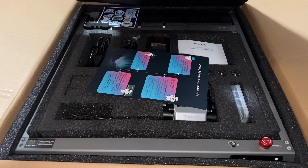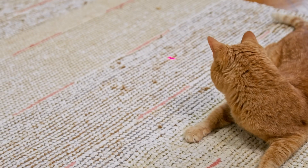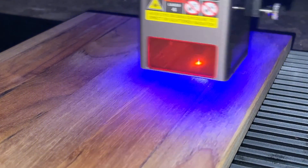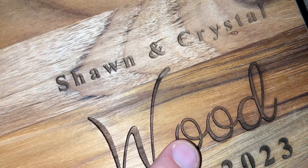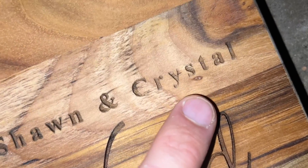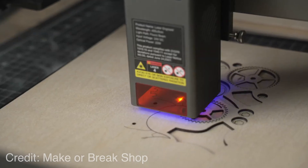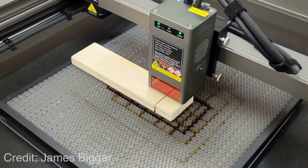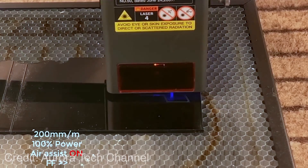Their Falcon 2 laser cutter is an example of a diode laser. It's like a laser pointer, but instead of entertaining the cat, it cuts through solid wood or plastic. You may hear the terms laser cutter and laser engraver used interchangeably — that's because these machines can do both. By adjusting the speed of the motion and the intensity of the laser, we can alter the penetration depth. Lower power and faster speeds give an engraving effect, marking the surface without cutting it. Higher power and lower speeds give a cutting effect, and the depth depends on those parameters as well as the composition of the material. Softwoods like pine cut relatively quickly and easily compared to hardwoods or plastics.